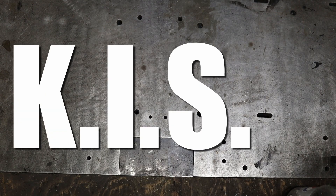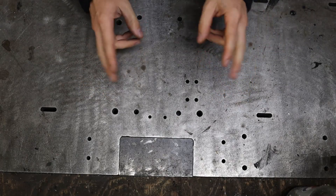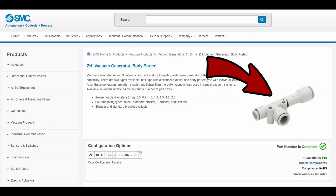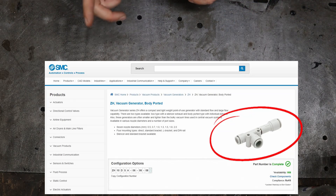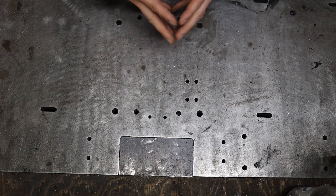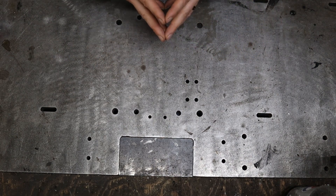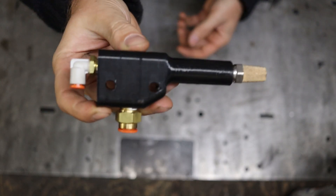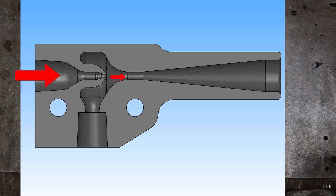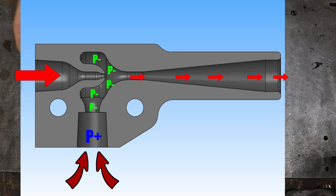I should keep it simple. So that brings us to my hopefully clever solution. Have you ever heard about vacuum generators like this one? These are really small, and from time to time I use them when I design robot hands. These vacuum generators are very useful to pick up small and light objects once combined with a vacuum cup. The principle is quite simple: you push air into a nozzle, the air speeds up in the diffuser, that reduces the air pressure, and because there's a difference in air pressure, that creates a vacuum right at this inlet.